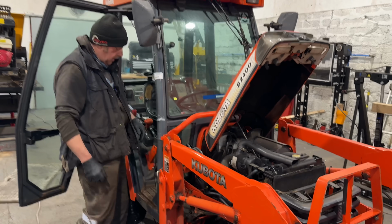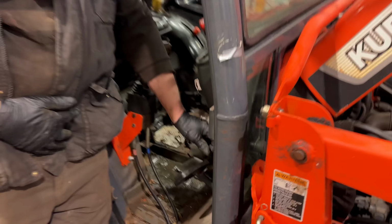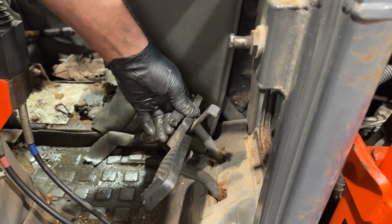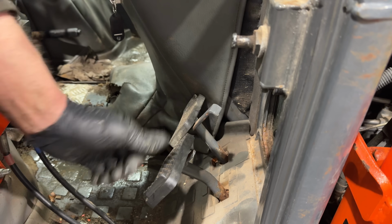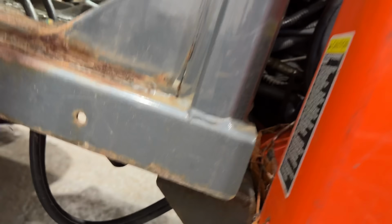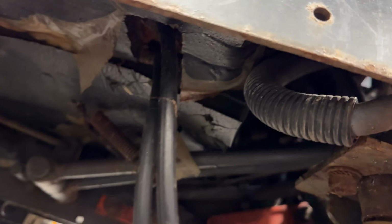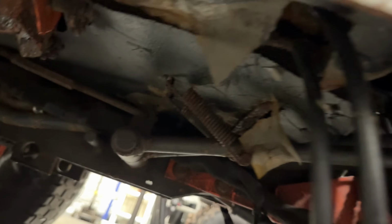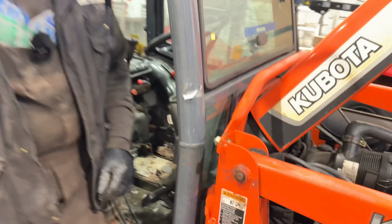Probably illustrates what the problem is. So we found it, Mike. It's persuaded that little lock and lever back up out the way, so that one goes down nice and freely. Yeah, and that one is the one that's... So somewhere along the line, we think under here then, bushes and pins. So just push the left-hand one. There you go. So you can see that linkage coming down there, and then that one. And then the right-hand one is that solid. You've got a spring there. So hopefully it's just a case of freeing up that mechanism underneath there. That's the first port of call.